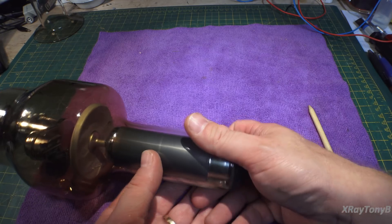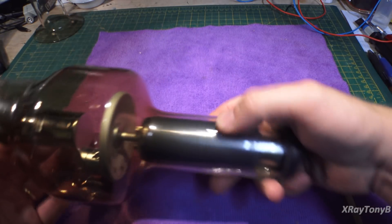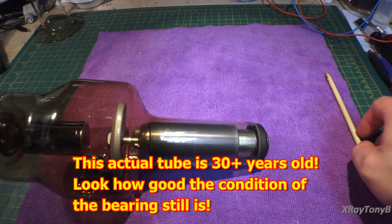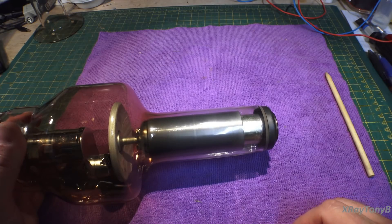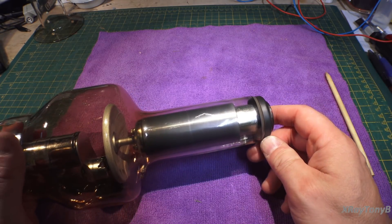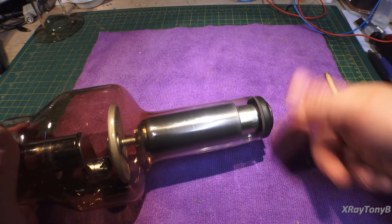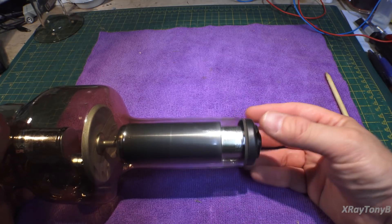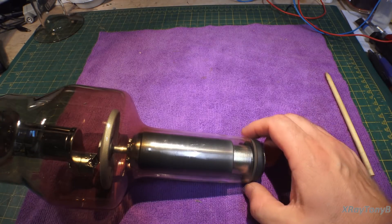This is a very, very high quality bearing. When I turn the tube you can see the anode hardly even moves because this bearing is so perfectly balanced and low friction — designed like that on purpose. It's not uncommon for older versions to keep coasting after you turn the x-ray machine off. This rotor could coast for up to an hour — I've seen it happen. We'd shut the machine off, go to lunch, come back, and the tube's still coasting. More modern ones don't use as good a bearing assembly or lubricant, so they don't last as long. Nothing's built like they used to be.